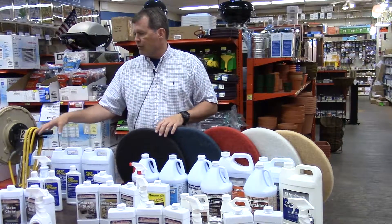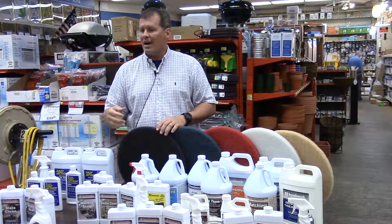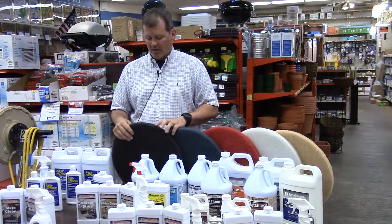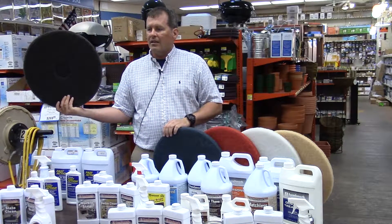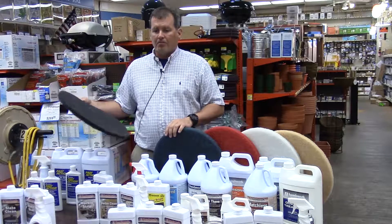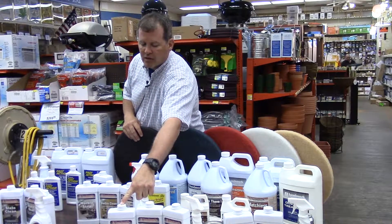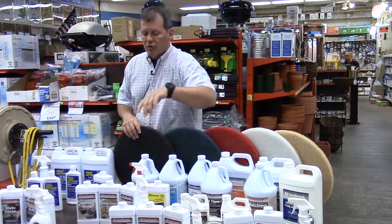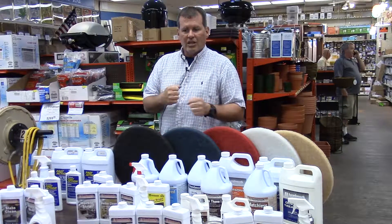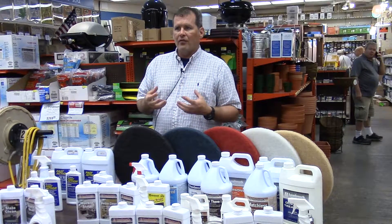When you approach a resilient floor in this kind of area, we would use Super Strip. Super Strip is a stripper mixed with hot water, applied to break down the cross-linking that happens within wax. You use a machine with an aggressive pad, go over the whole area, then vacuum it all up to remove the wax from the floor. On the retail side, that's mirrored with the High Power Wax Remover. At home, you don't need to rent all of this — a mop with simple agitation and hot water will be enough.